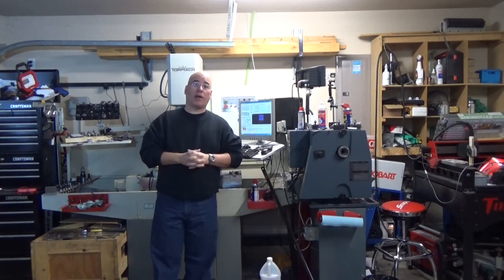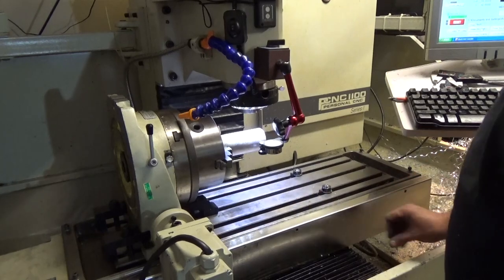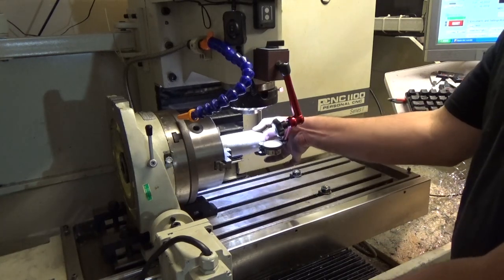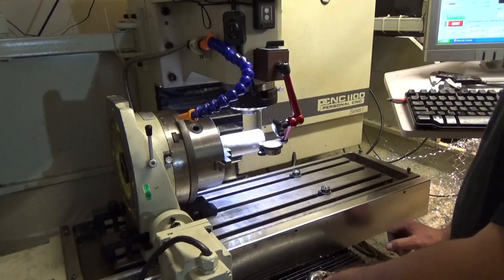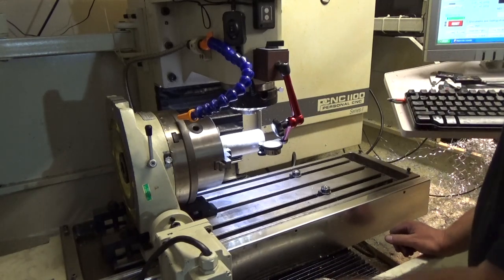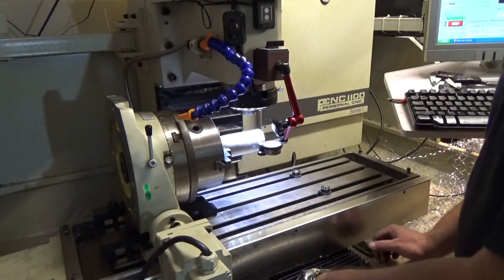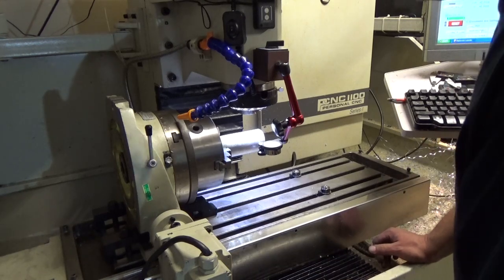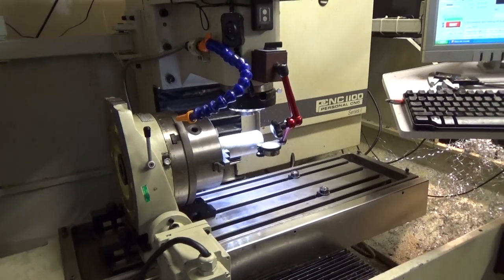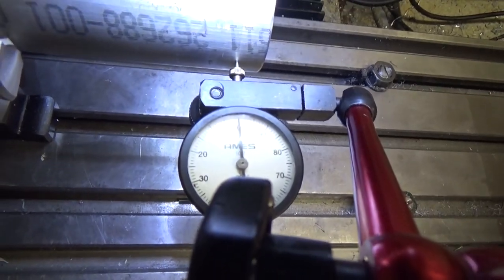I will try to explain that in a number of my videos, but on this video I just want to show you how to manufacture this part. So here is where we are so far: I have placed my fourth axis attachment into the table, added the chuck to grab the part, and I have already faced a piece of two-inch diameter 6061 aluminum. I've placed an indicator on my machine column and I plan on making sure this is aligned, because if it's skewed it will give an angle to our features.